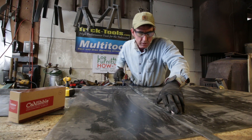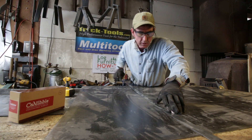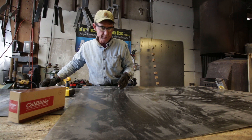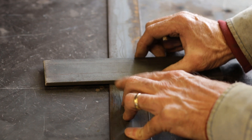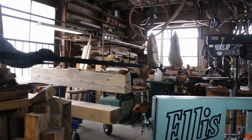What I'm doing here is taking a minute to draw out the exact size of our table top, and then we're going to take our four-foot level here and make a mark from corner to corner so that it will help me determine the actual size of our framework underneath. Then we're going to cut our two-inch by quarter-inch strap.